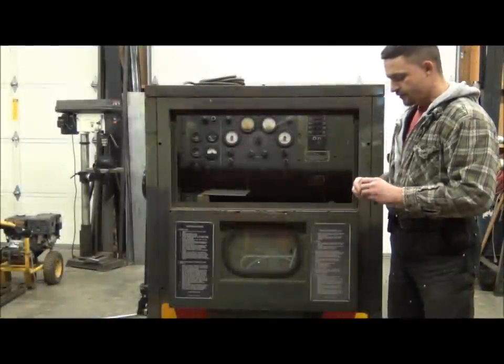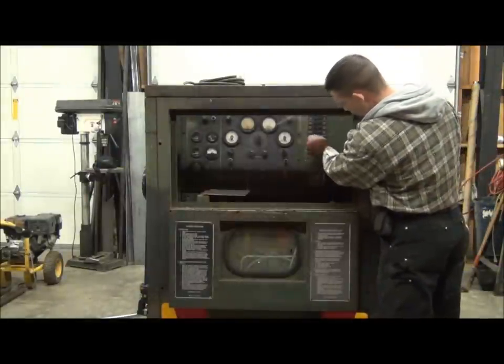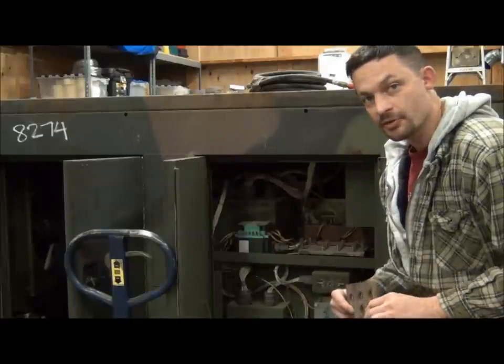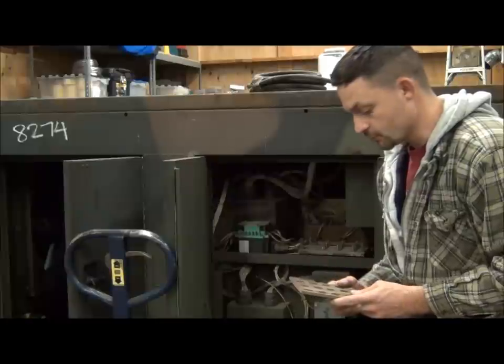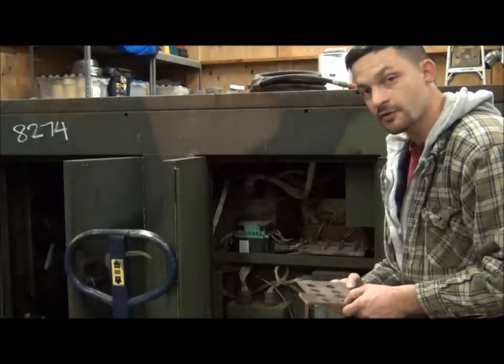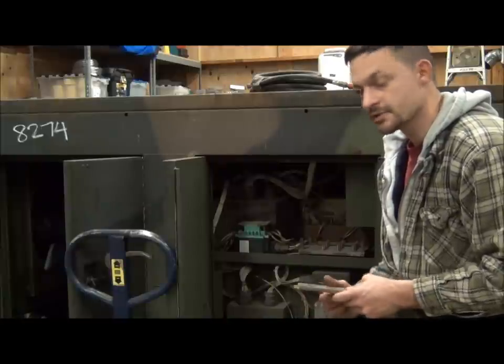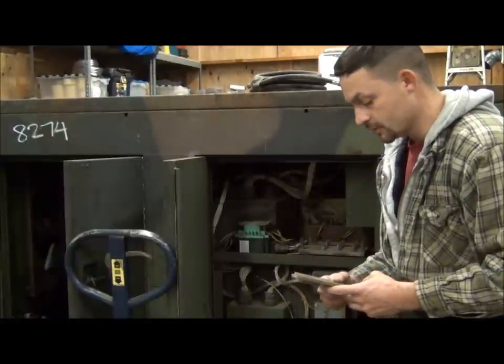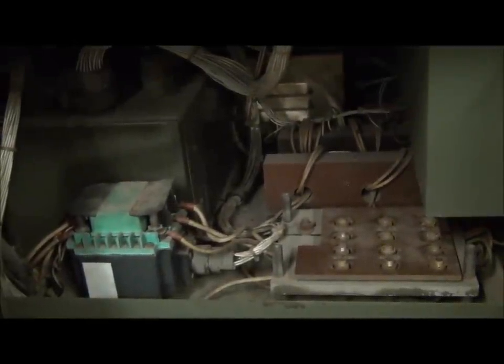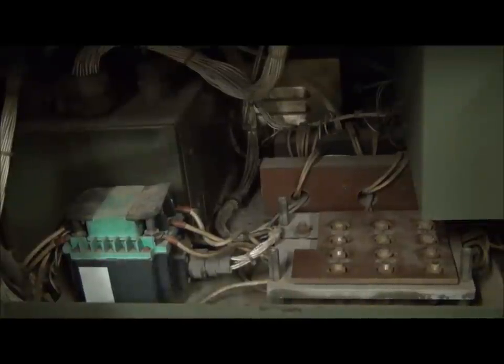Starting in this panel, I've tracked down a spare fuse cap and will go ahead and install that. Inside the main panel, all we had to do was tighten up a couple of loose leads and install the voltage reconnection board — I have the reconnection board right here. There's also a protective cover that goes over the top to protect leads against shorts, but I'm going to leave that off since I intend to do some experimenting. We've got the voltage reconnection board fully installed and tightened up, and the leads going to the main circuit breaker tightened. We're all done inside this panel.